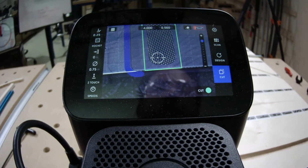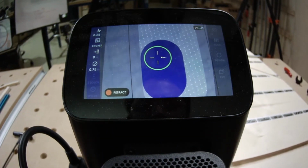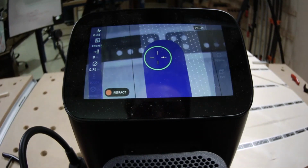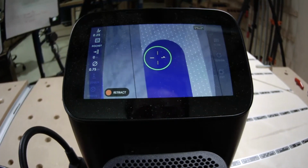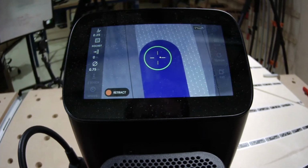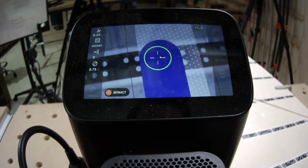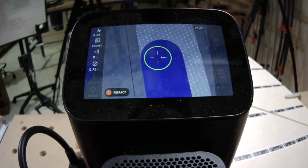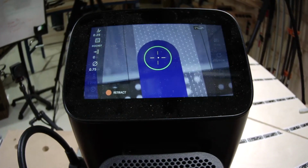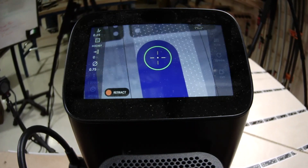So yeah, we touched on this briefly, the idea of not pocketing 3/4 of an inch deep with a 3/4 inch wide cutter. The reason for that is that the material that you remove is a function of the area of cutter that you present to the workpiece. So you can think about that in terms of a 1/4 inch wide cutter times a 1/4 inch deep equals a 1/4 times a 1/4, I guess that's a 1/16 of a cubic inch. 3/4 inch cutter times 3/4 inch deep is actually 9 times more material removal than a 1/4 inch cutter.